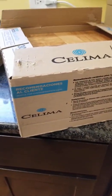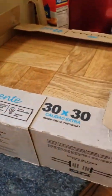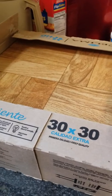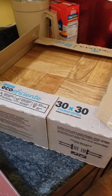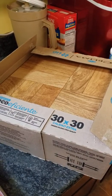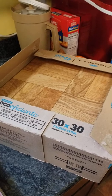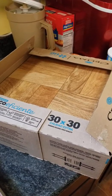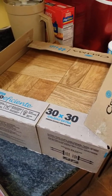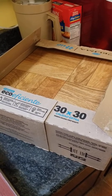One of them is the Salima ceramic tiles. These are 30 by 30 centimeter, or 12 by 12 inch as you can see here, and these are actually a PEI grade 4 tile. What that indicates is that it is a second-to-highest grade possible for the hardness of these tiles — in other words, some of the most impact and scratch resistant tiles based on industry standards. They're rated for light commercial and for really heavy foot traffic within residential applications.